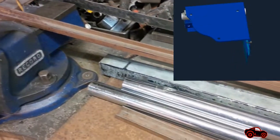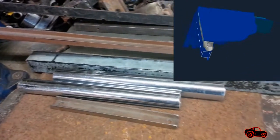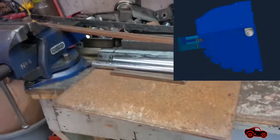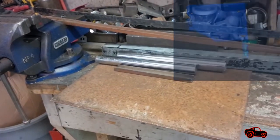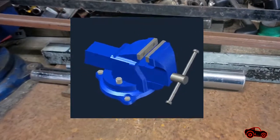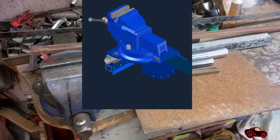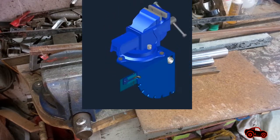Because the weight of the bench vise assembly was 48 pounds, I used a strong steel plate to fabricate the tilting base. To avoid making too many mistakes during the project, I began by drawing the vise and the swivel base with a 3D modeling CAD software. This procedure helped me to design the tilting components and to evaluate the moving parts.